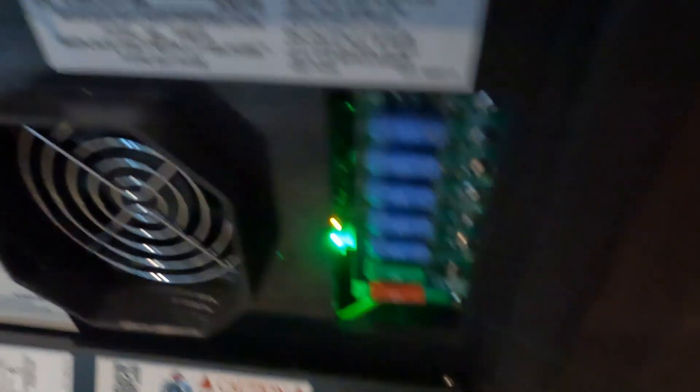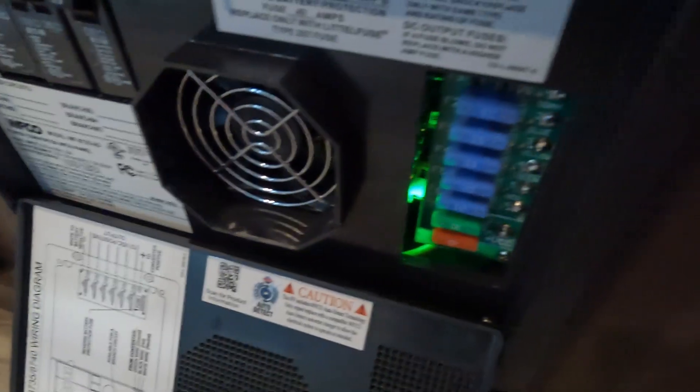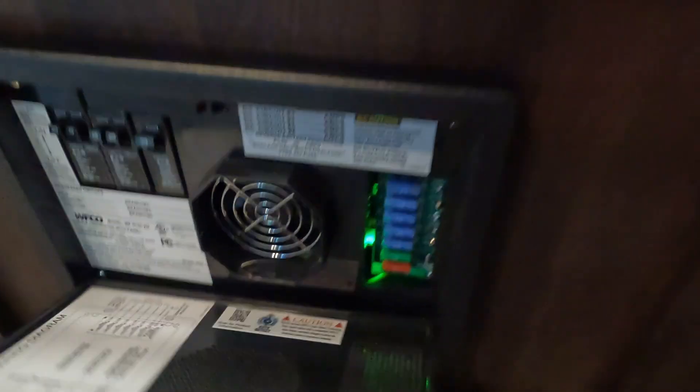I got back from camping, we cleaned the camper up, and I left it unplugged from shore power. So I was running the fan, turning on the lights — I wanted to run down the lithium ions as far as I could. I ran them down to 4%. I thought that's got to be good. You look in your panel — there's always a green and an orange light — those lights were on even until I drew them dead. So I plugged it in, went to work for a few days, came back and they were still charging. The lights never changed.